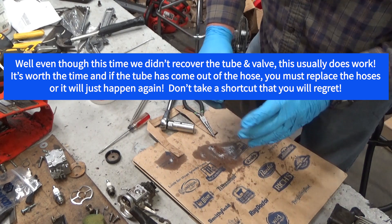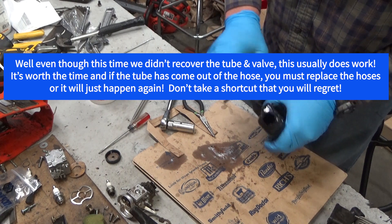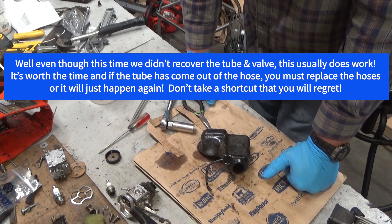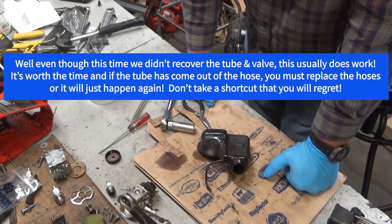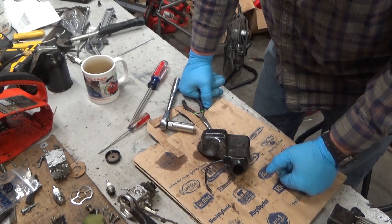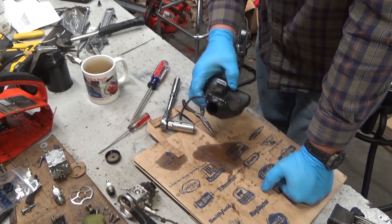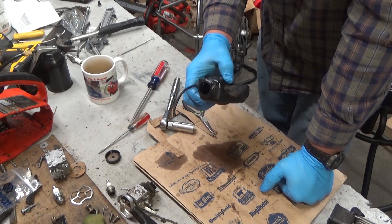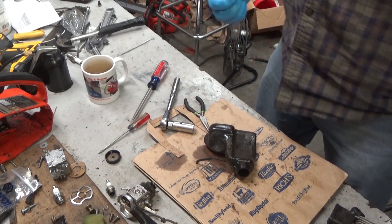Now we'll have to use an alternative — some sort of tube. There's the part number 07508 that was used on the late model Super 2s. It's a plastic fitting. That's what I'll end up using in here when this saw goes back together. That in a nutshell is what you need to do: identify what kind of oiler you've got if you have one of these XLs, then exhaust all alternatives before saying the connector isn't in the tank. Because if you get that little bronze tube out, you can clean it up, slip a new duckbill on, slip some new hoses on, and away you go for a whole heck of a lot less money. That's the procedure, folks. Hopefully this helps.